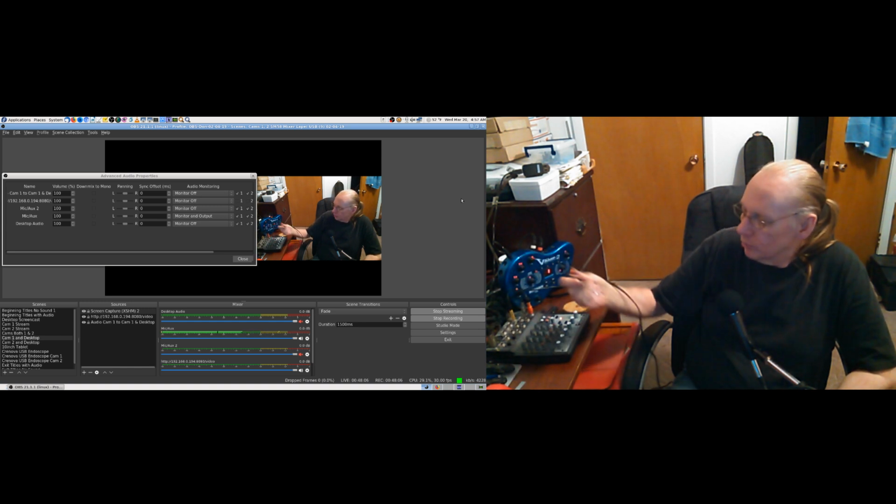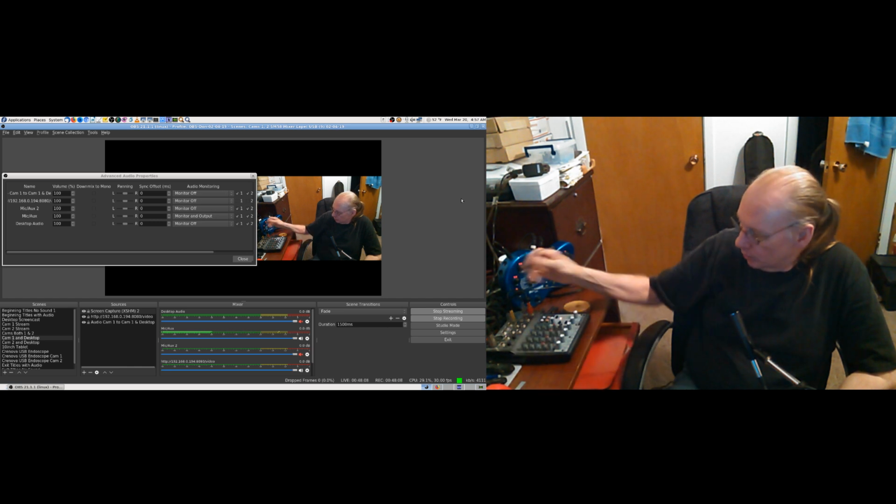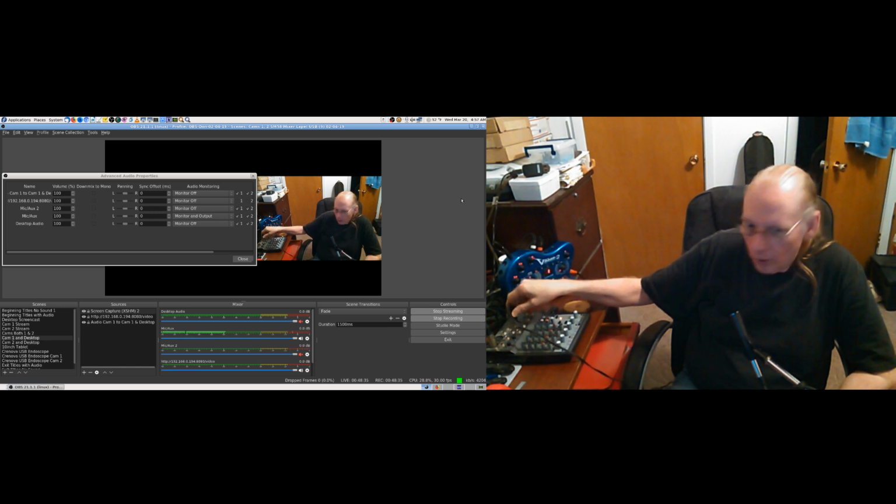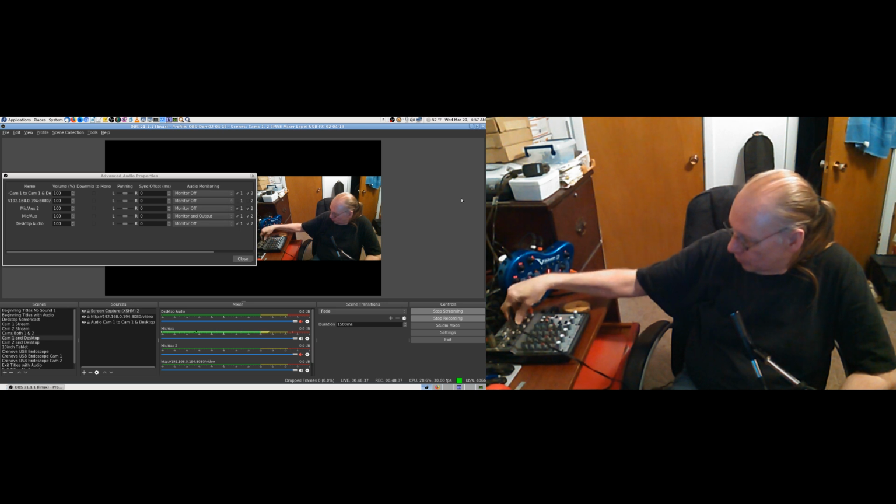For instance, if you have a TRS cable, a stereo cable, and you want to use it in a mixer that accepts either balanced or unbalanced, you could plug it in about halfway to the first click. You can feel it real easily, and it would work. Sometimes that's all we had. Just make sure some doofus doesn't walk up and say, "Oh, that's not in all the way," and shove it in for you in the middle of your show. Or don't do it to yourself either. I never did that.